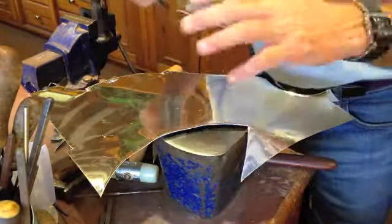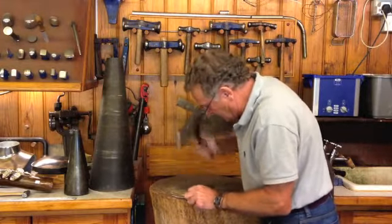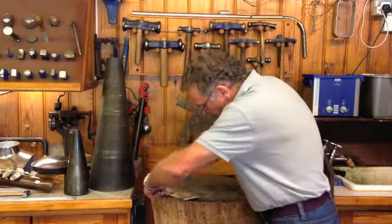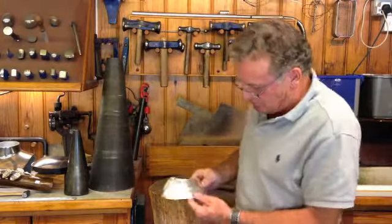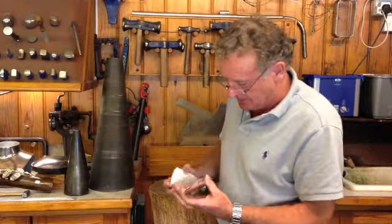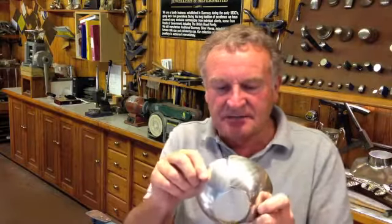So that's one half of the milk can. Then I'll do exactly the same with the other, and then I'll take them over to the tree trunk and start to block them up. Now if I just show you already how it's starting — the roundness is starting to come together. I'll carry on doing that all the way through until I get them up to the correct shape to form the top section of the milk can. Now I've finished the blocking; you can see the two halves of the milk can, the top section as they come together. They're lovely and smooth now — it's just been done with the hammer.